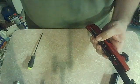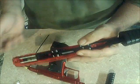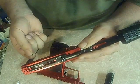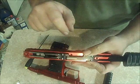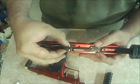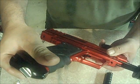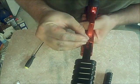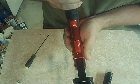Okay, and here's the other thing I noticed. The original O-ring that was in here, I tried putting it together. I had this thing apart 15, 20 times. And eventually, at some point, I cut the O-ring because I put the handle on wrong. So what I did was I'm using a 003 O-ring, same O-ring they use in Cocker 3-way shafts, and just stick that in the hole. It's a little bit big, but whenever you put it all together and squish it down, it works just fine. Just got to be careful you can't slide it around as much as you could with the other one.